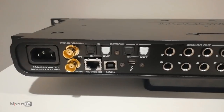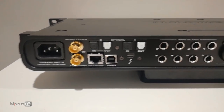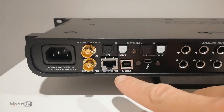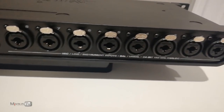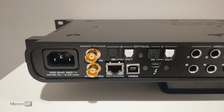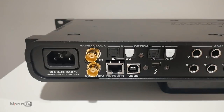Connection to the PC was the other big thing — I wanted Thunderbolt. My MSI laptop is one of the few Windows laptops with built-in Thunderbolt connectors, so I purposely built this system around the MOTU. The 8Pre-ES has both Thunderbolt and USB 2 high-speed, compatible with USB 3. The interface is capable of a low 1.6 millisecond round-trip latency at 96kHz over Thunderbolt, carrying up to 256 audio channels (128 in, 128 out), with AVB/TSN Ethernet via standard CAT5e cable up to 100 meters.